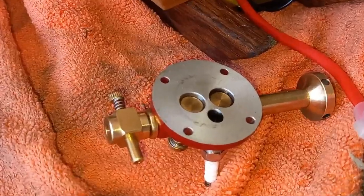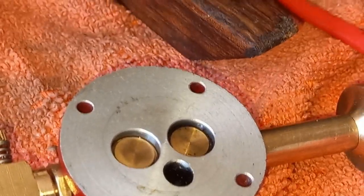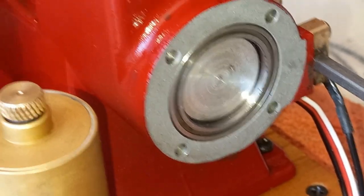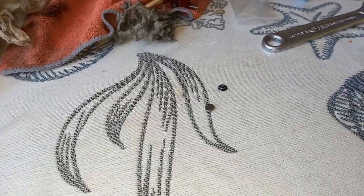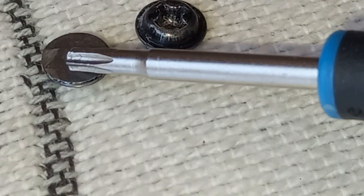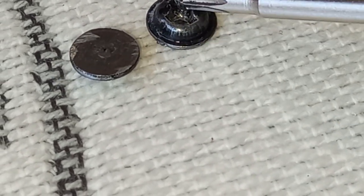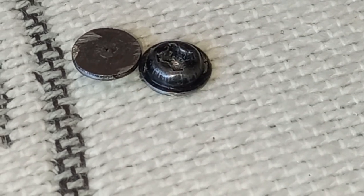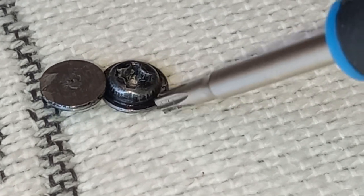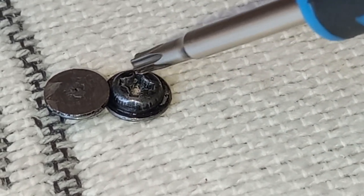After cleaning with a little bit of rag and petrol, we have nice shiny brass valves in there and a clean piston in the engine. These are the screw heads that I used, super glued onto the valves. You can then run a screw in and push the valves. I've done this on the smallest Sam hit-and-miss engine and it worked a treat.